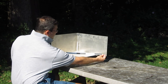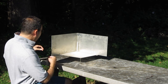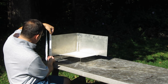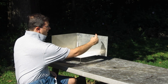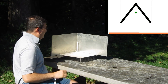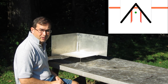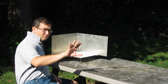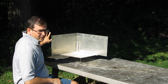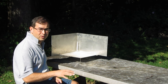So let's measure the size of our antenna. It looks like it's about 62 centimeters wide by 26 centimeters tall, and so this is the aperture of the antenna. The radio waves will come in and they'll be focused down to the receiving dipole here, and that will increase your signal quite a bit. It will also only take radio waves coming from this particular direction, rejecting radio waves coming from the back, so you can have some directionality to tell where your sources are.